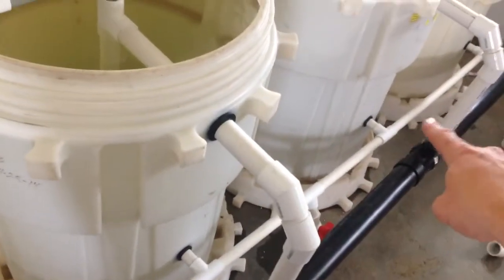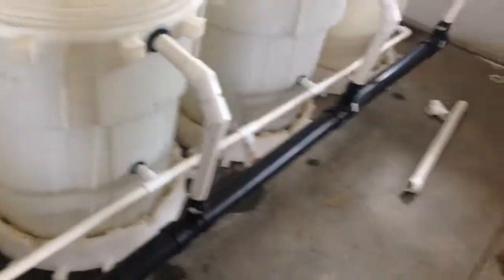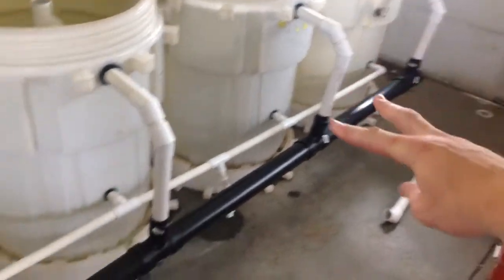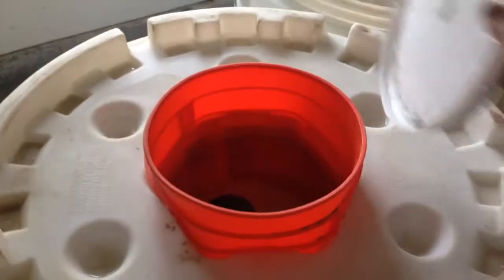This line down here on the bottom is simply a leveling mechanism to make sure that all four of these fish tanks — and it replicates itself on the back side — stay the same level. So it comes down through the solids lifting outlet, comes down here, hits the three-inch line, the three-inch line comes up over here and hits this tank right here, which is called a radial flow filter.